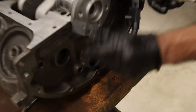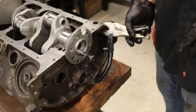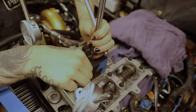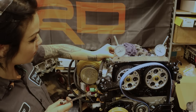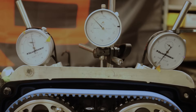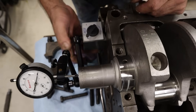On my new Supra, I was trying to do brake rotor run out and all my suspension components are aluminum — I really needed that. A lot of times I have a plate with a bunch of holes in it and I have to bolt that to an aluminum block or aluminum cylinder head. Which is exactly what I had done when I was degreeing my cams. For the dial indicator that I had for TDC, I placed my magnetic base on a flat piece of steel, and for the cams I had to fabricate my own holding brackets. In so many cases, you're going to find that the actual process of setting up the dial indicator on a strong, solid base will be the most challenging element of taking a measurement. But thankfully, crankshaft end play on this cast iron block is a breeze for setup, which is why it's the perfect example to use today.